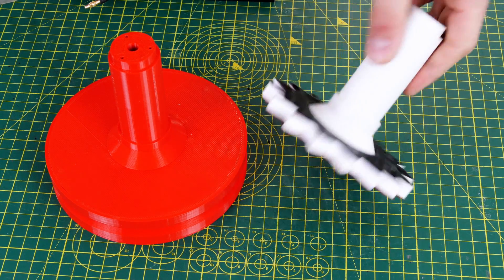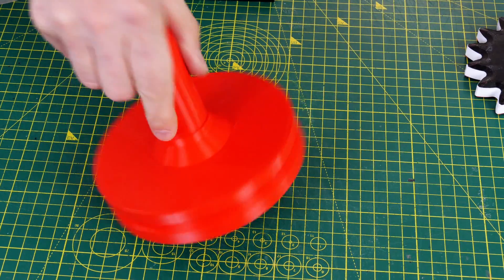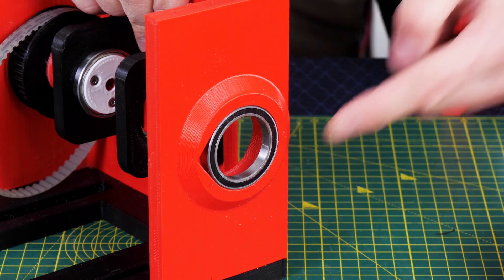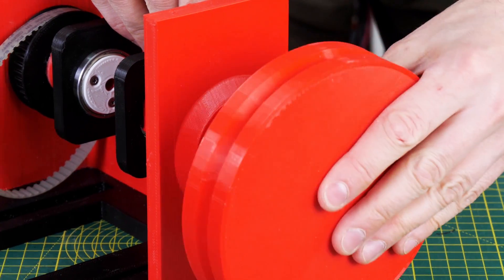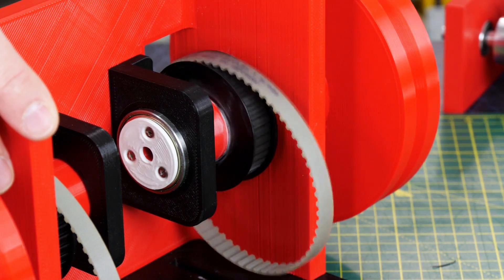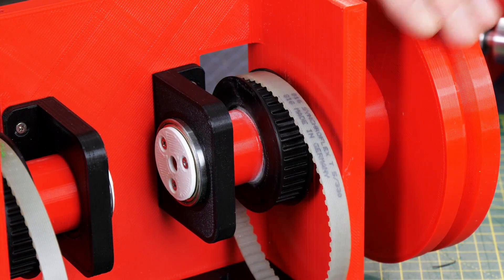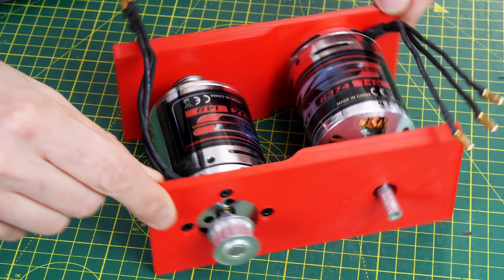The first thing we need to do is get rid of those sprockets that were running in the rotoped track and replace those with normal wheels. I've got a 3D printed wheel hub that fits into a bearing on the outside as it did before, so that should slot right in there, and on the inside it rides in another bearing with a cap that stops it falling off. There's also a T5 pulley glued on so that I can power that with a motor.